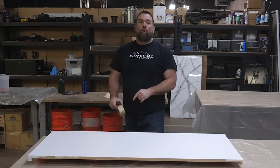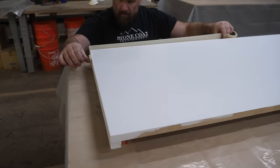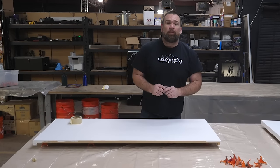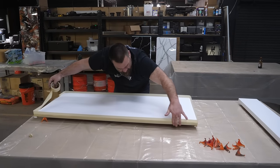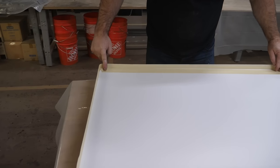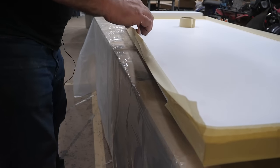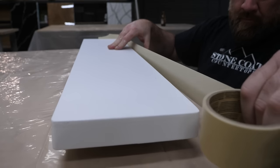I'm doing an exotic pour white marble for this project, so I'm going to create a tape dam. This step is optional but good practice when using the exotic pour method. The exotic pour method is where I set out cups, tint them individually, then pour them back in a bucket. We use a little additional epoxy — four to five ounces per square foot rather than three. To keep those color techniques on your board, create a tape dam. I'll peel the tape dam about three to three and a half hours after mixing. I use two-inch contractor's grade masking tape, a couple rows, focused on applying it nice and tight to the edge.